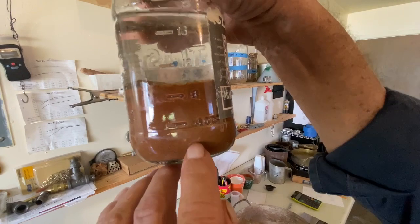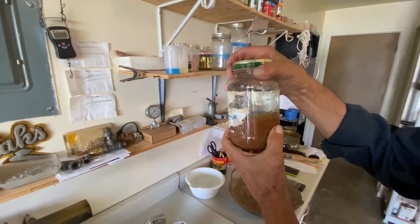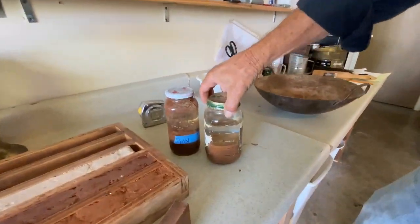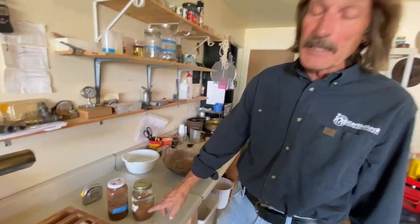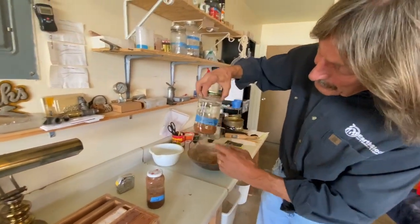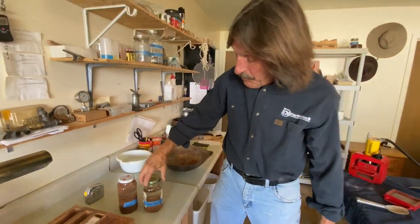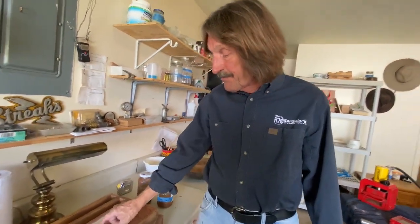It's not going to affect us in making these blocks because the other soil we're mixing with it in a much larger quantity is really sandy. You can see a line here — this is all sand up to here, and then you've got the clay and silt above that. So this is a much sandier sample. That's going to cut down this expansiveness, and the stabilization also helps with the expansiveness. It's hard to tell the difference between the clay and silt — some silt particles are as small as clay, so you can't be certain that quantity above the granules is purely clay. And if you're highly expansive the material goes above the piece of tape; on this sandy one, there's nothing above the tape — zero. These are the same two soils we mixed to make the blocks and tested in the shrink box.